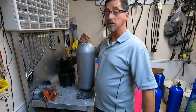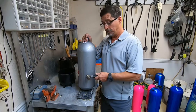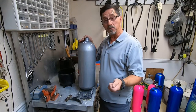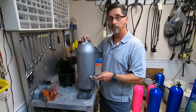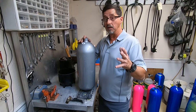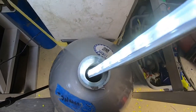One thing in addition that we do with steel that we do not do with aluminum is the hammer test. A good steel will have a bell tone when struck with a hammer. If it has a dull thunk sound, the steel has gone rigid — no good. The bell tone tells you that the steel is still elastic.